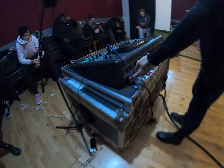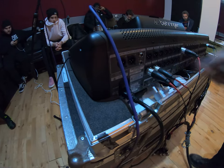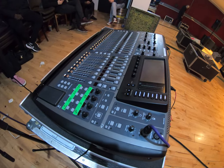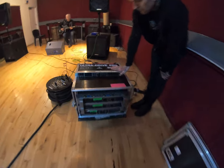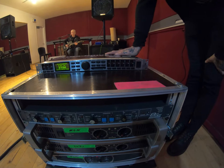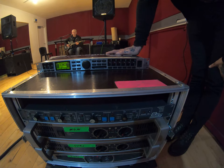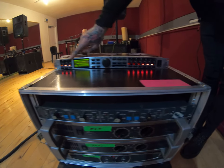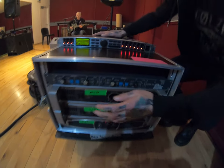Powering on: desk on first, so flick on the desk at the back. Then over to your crossover — crossover on. Make sure it is all muted. Wait a few seconds for it to come on. Our outputs are muted, our inputs are muted — that's what you want.